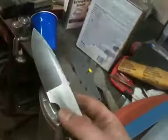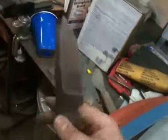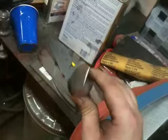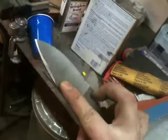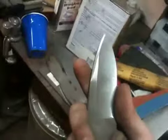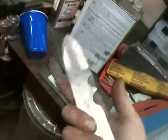Personally my favorite is a full flat grind, or maybe a majority flat grind up to a point, but I do like hollow grinds and other types as well. As you can see, I wanted to try something different and branch out a little bit on this one. I also went ahead and put a swedge on there, which is something I don't normally do. It'll need a little more blending and refinement, but I think it's going to come out nice. I'm definitely excited to get this heat treated and finished — this one will probably go for sale as soon as I can.